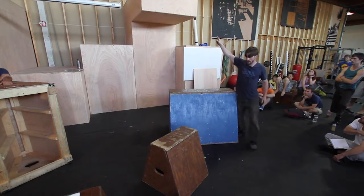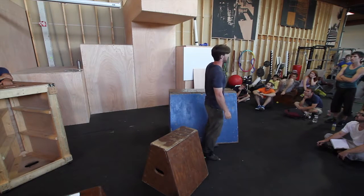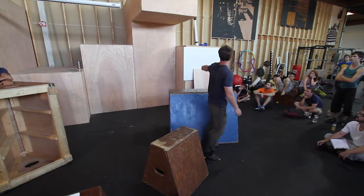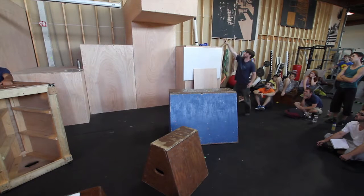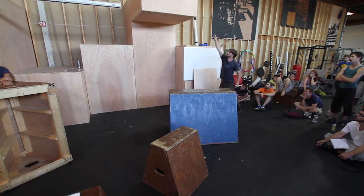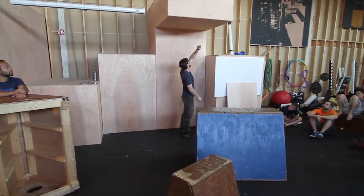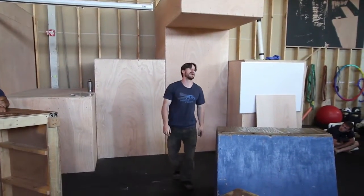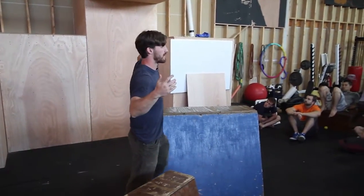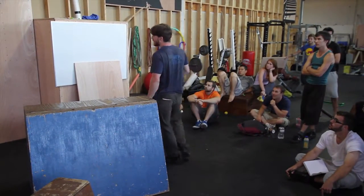This box here has no diagonal supports in it at all. This gets its strength entirely through plywood. That's how strong this is in shear. This box has a plywood sheet on the outside face here on the edge. That is one big sheet that comes from the top back to the back, and then 2 more feet down on this top edge here, and that has that same sheet on the inside edge. So the inside edge that you can't see has another plywood sheet that runs down. And this side has another one that runs down, and another one that runs down. So it has 3 inches of plywood that is 4 feet long, that goes all the way back to the box, that's held in by 100 screws maybe, right? And that gives it a lot of stability.